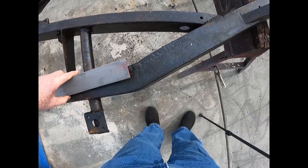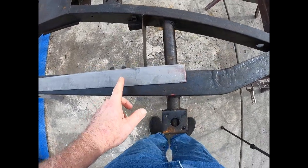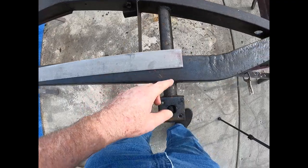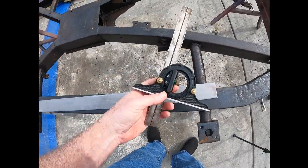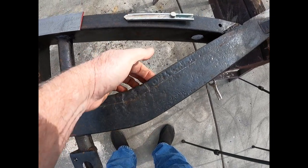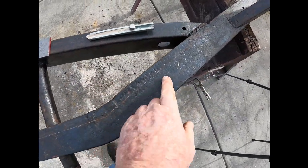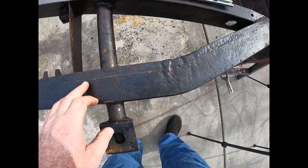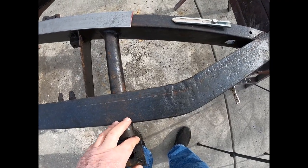The first thing to do is to measure this angle, then I'll use half that angle on the cut, so I'll flip one piece over and the two added together will make this angle, and the length of the seam will be the same on both sides. I've got an adjustable protractor here to measure that up. The flange is 5 eighths — I measured back 11 sixteenths, adding a sixteenth for the thickness of the metal in the web. I'll grab a straight line here and one there — this is the intersect, the center of the angle — and then I'm going to cut this. I'll use a cutoff wheel at least to get the hole started and then may go to the sawzall.